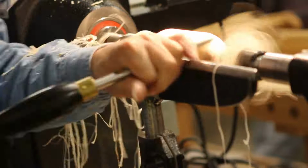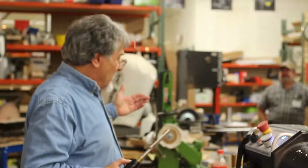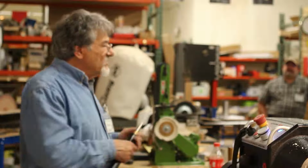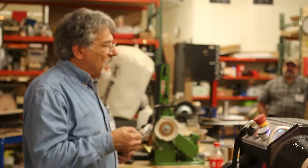All right. So now having done all that, maybe now I'm wondering, is this chisel really as sharp as it was? I've done quite a bit of turning. I may want to sharpen this. So you probably know that I'm an advocate of belt sharpening. And the reason is simply because with a belt machine, I can sharpen this chisel in 7 seconds. And I never use hand hones, because in a belt buff system, there is no hand honing. Hand honing is inaccurate, because it's done by hand. And it's also very slow, because it's done by hand.